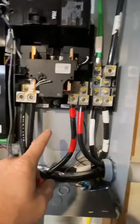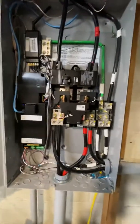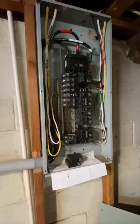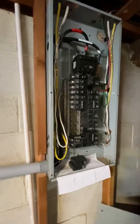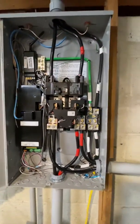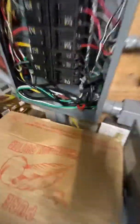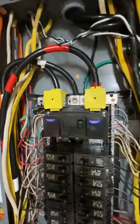Then you have the load center — two branches for each load center. I do have two panels. I have a 200 amp there, and having a full electric house with two electric cars also, that is two panels. Then I ran a second one to feed the lower portion of our basement because I do all electric floor heat and everything is electric here. There's no natural gas, no oil, nothing else. There are your feeds from the utility connecting to the feeds going to one breaker box over there. The other ones go through the tube, around through the conduit, come back up through the conduit here, and come up the side of the box to the top to feed my panel.